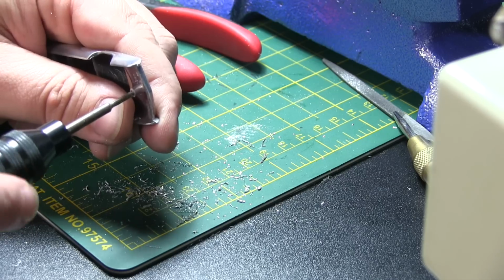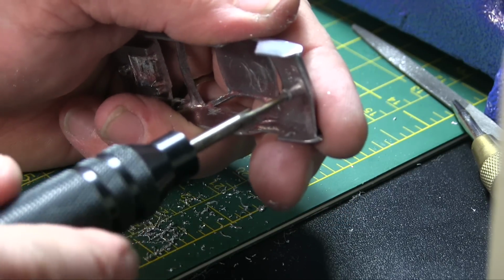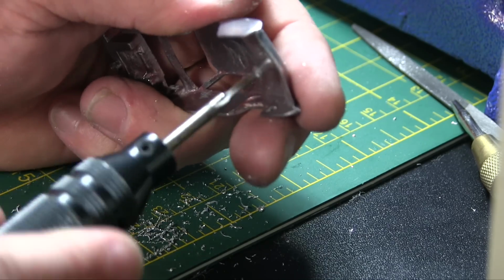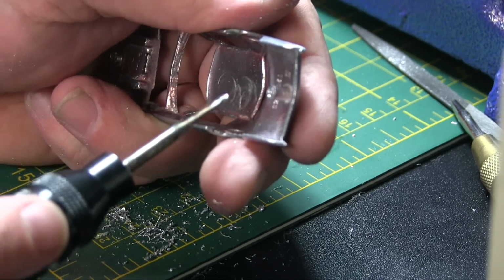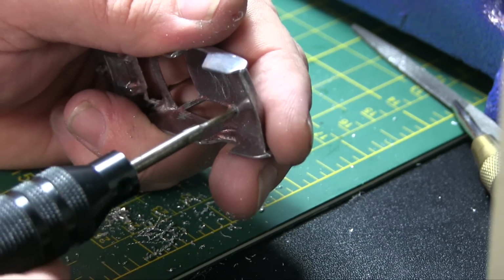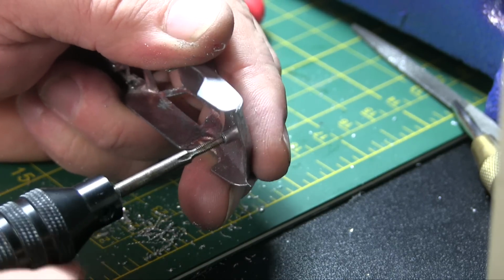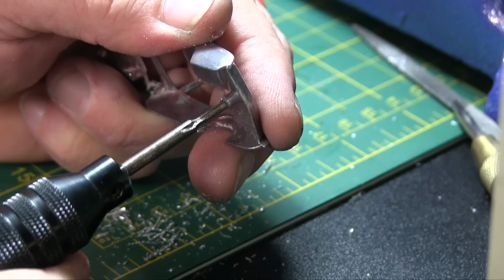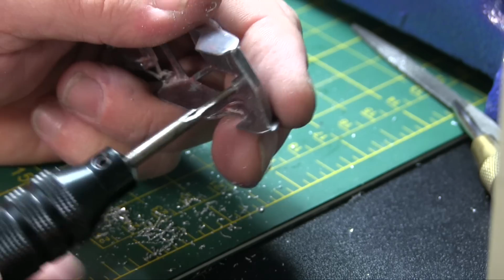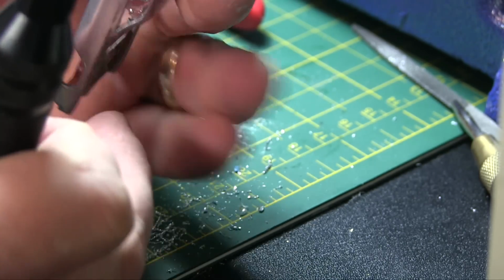Now I'm taking the tap, and I also have this in the description below, and I'm tapping out for a screw. Now if you were going to do a so-called complete restoration, you would not need to tap these. You would just simply drill the hole and then you could glue those rivets in there. I like to put screws in there just because, well, first of all, I don't have any rivets. Second of all, that makes it nice. If you ever want to take it apart again, you just unscrew it and you can take it apart, screw it back together, you're good to go. So with the tap, I just go in a little bit, back it out, get any of the chunks out of there, just a little bit at a time.